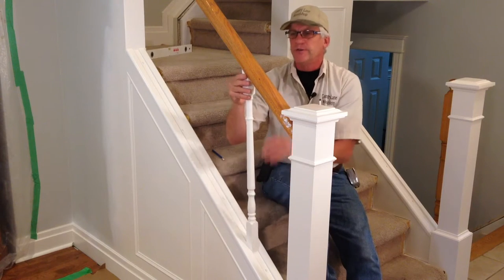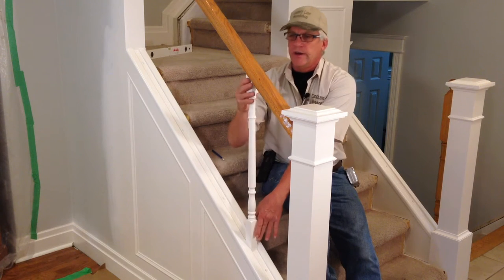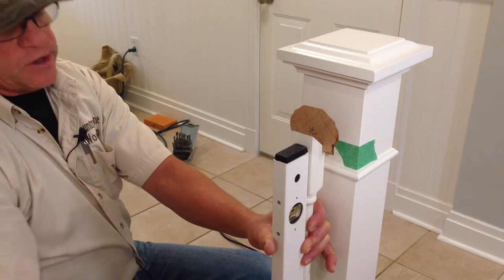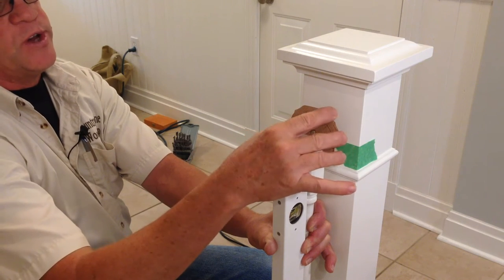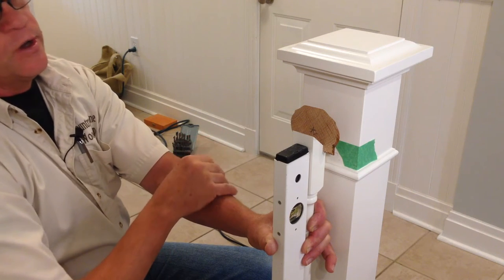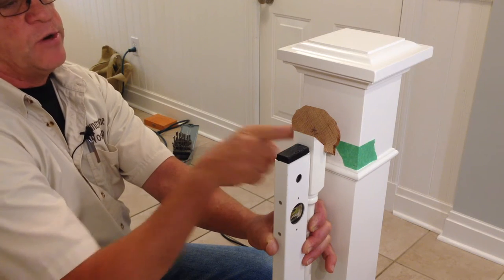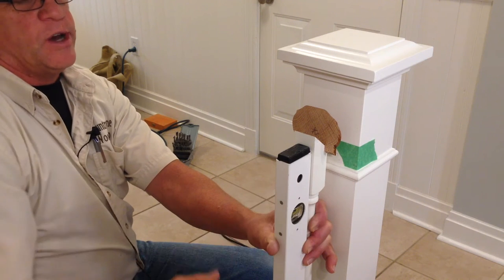What we'll have to do with our new handrail application is make sure that these all fit in and are plumb. I typically make a little piece of the actual handrail we're going to use — it fits onto the spindle, and now we're able to determine the actual spindle length. This mock-up is actually going to allow us to determine the exact length and how it's going to mount onto the newel post. We've determined roughly where we want to mount our handrail, and at this point we're ready to proceed on determining the actual length of the handrail.